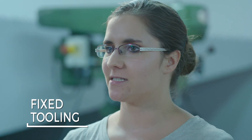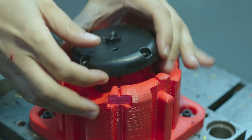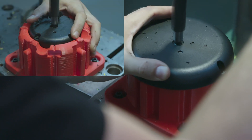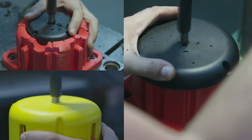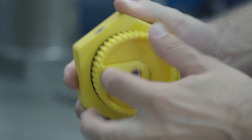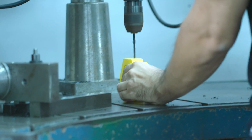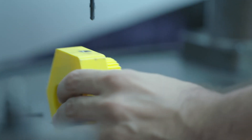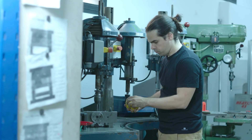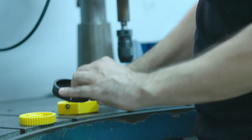This tool is fixed and centered on a drill bench so that we can then mechanize up to five different parts using a special drill bit. Inside this 3D printed tooling, we place a plastic part, then we close it to help it stay in place. We drill three holes at 120 degrees. Standard pieces such as screws and bushings help make this piece 100% functional in our everyday work.